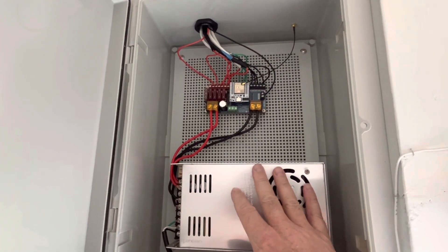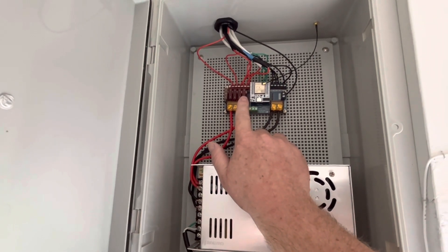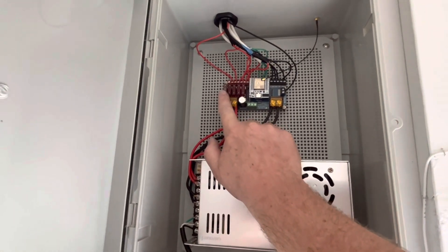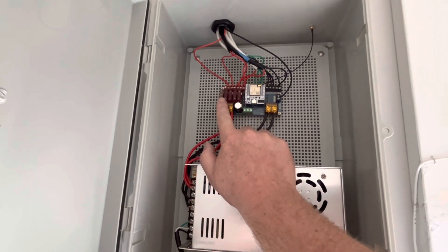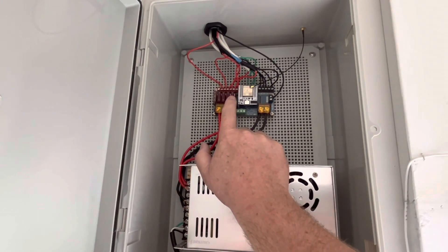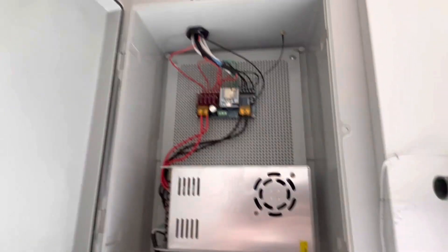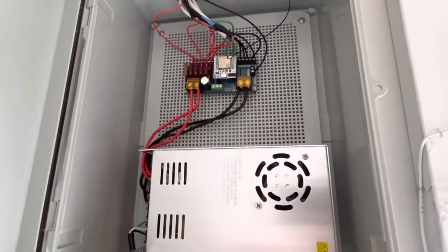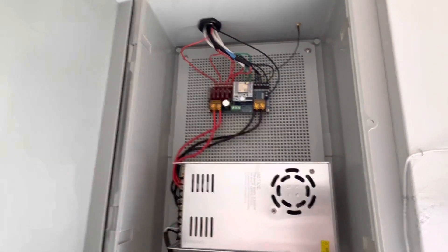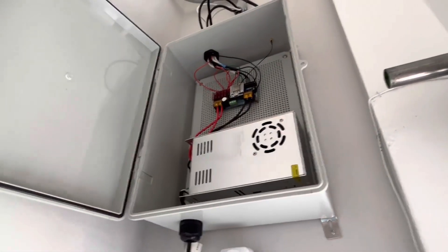I'll leave it all in the description below so you can check out the stuff I used. There are significantly more LEDs on this DigQuad than the other ones, so I changed the fuses out to 10 amps — this one remains a 5-amp fuse. This is what Quinn LED suggests if you're running a lot of LEDs on your DigQuad — bump those up. I haven't had any issues with that yet. So in total I have three DigQuads: two of them are running 5-volt LEDs and one is running 12-volt LEDs. You have to keep them separate — you can't mix and match because 5-volt LEDs can't have a 12-volt supply.